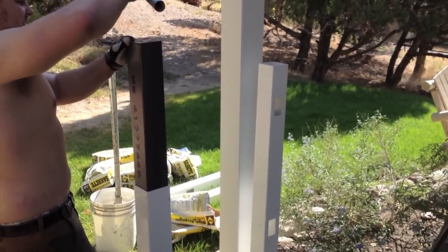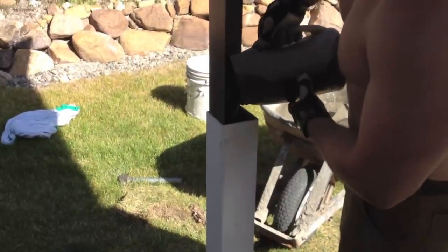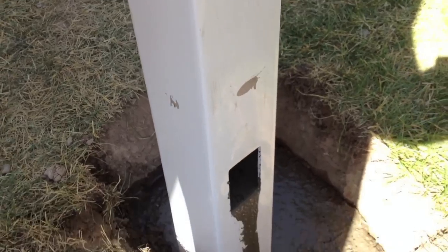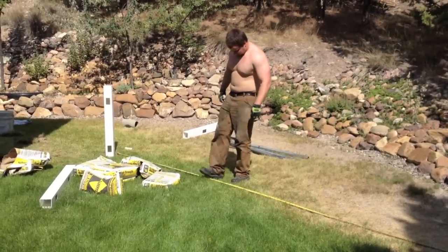This piece of steel is for the hinging post of your gate. Fill the inside up with concrete to ground level. Make sure you do not go above the bottom rail. Steel is a must for the gates — the vinyl post alone is not strong enough to hold the weight.